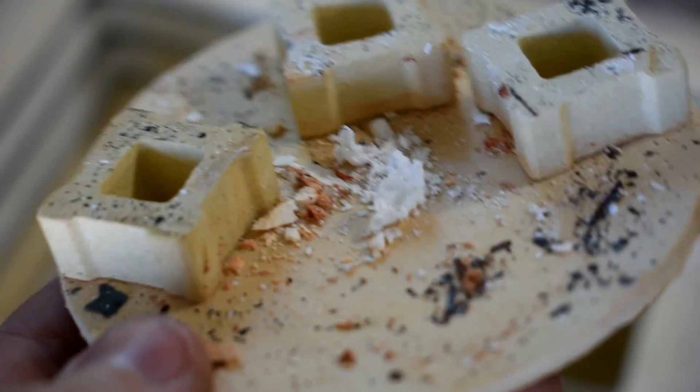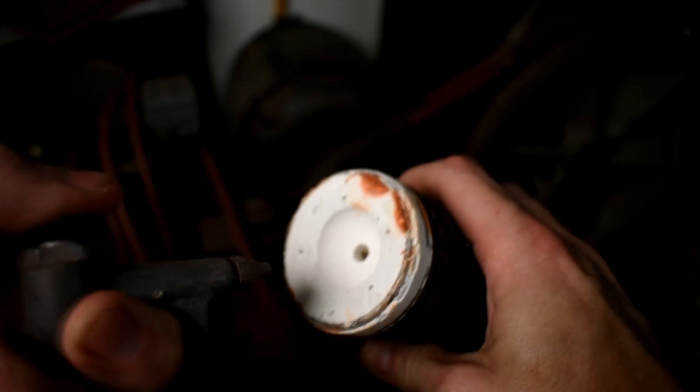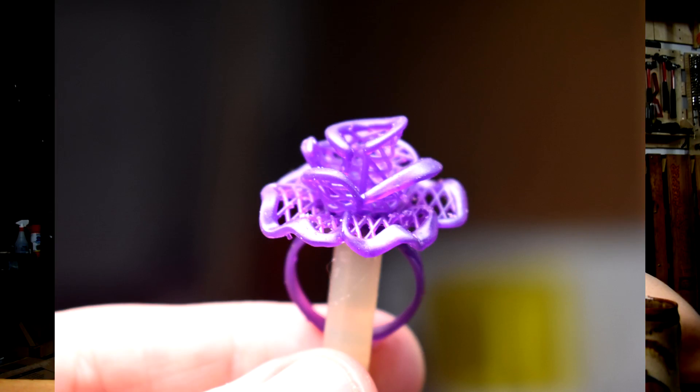There was one difference: usually when you're burning these out, after it's done you cool it down to the pouring temperature. I didn't do that — I let it cool down to room temperature. You can kind of see it left a bunch of ashes in the bottom of the oven; there are also ashes inside which I really couldn't get on camera, but they're there, trust me. Here's where the air compressor comes into play. I spurted a little compressed air into all the little vents in the sprue, trying to get the ash to blow out. There was a lot of ash in there, and also a bit of fine white powder that I later learned was a terrible sign.